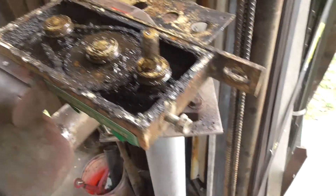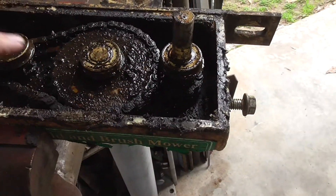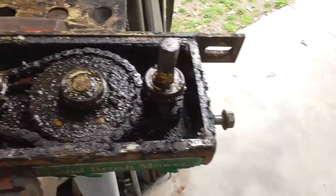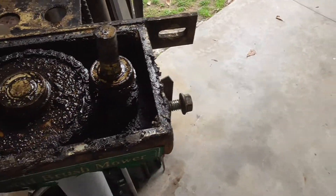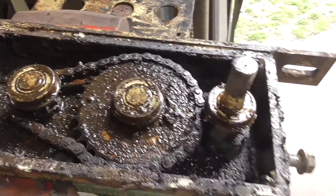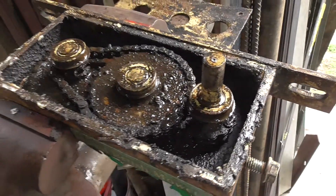The shafts are still in good condition. I'll probably redo the chain too. So I'll carry along as I figure this out — I have no idea how to get these off or out. The bearings are still fairly good, which is really surprising for being in this box. It was sealed — this is all silicone, still fairly pliable. But obviously a bunch of crap got in here. Grit and everything just wore this poor thing out. The bottom of this is just full of crap, dragging through that and carrying it all up into the teeth.